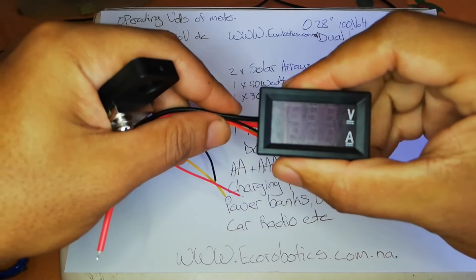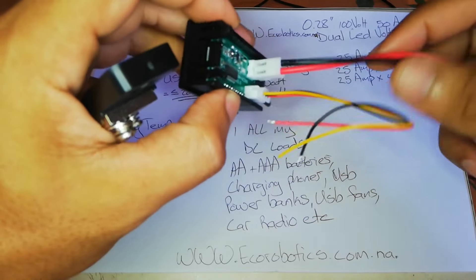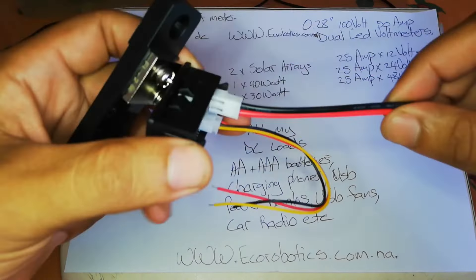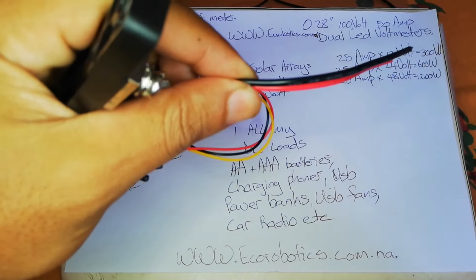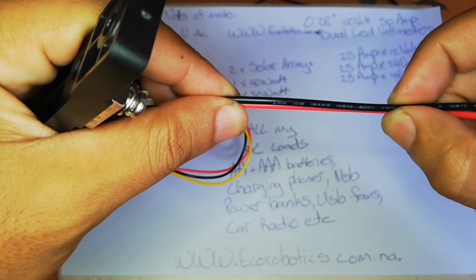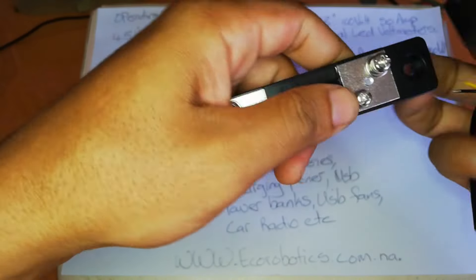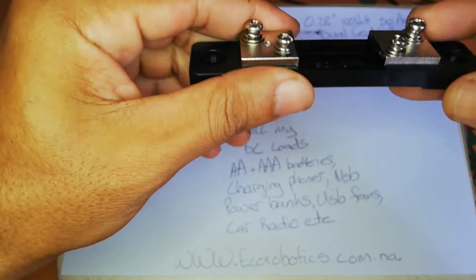So for starters, the head unit itself has the voltmeter and the amp meter. This is what reads the amps across the shunt, and these two cables deliver that information to the display unit. The cable is rated for 600 volts, 18 AWG, and I believe supports up to 7 amps — this just reads the information passing across the shunt.